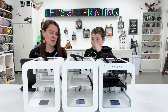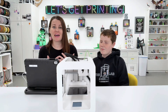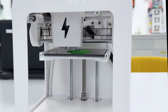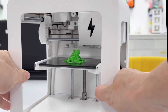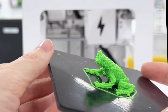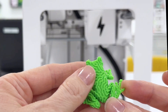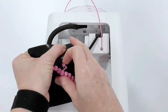Now that we've had them compete, let's test out some quality control on the Alpha 3. What do you want to print first? A frog. We found what we think could be a really cool test print — it's the beautiful, detailed tree frog. It's going to take 15 minutes and it looks kind of intricate, so we're going to give this a go. Froggy looks done — he actually looks pretty good. This is a very intricate squiggly pattern here. Anything like this I usually just take a heat gun very gently or use my little snippers and give them what I call a haircut. Pretty nice detail. Next we thought we would test the Alpha 3 by running an articulated print, and this axolotl is one of our absolute favorites. Came out perfect.